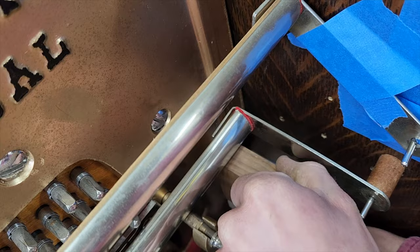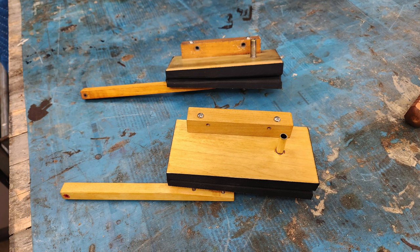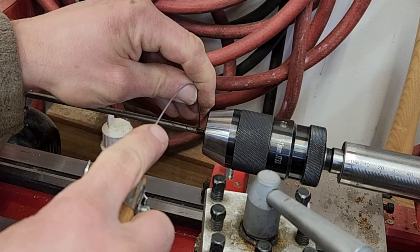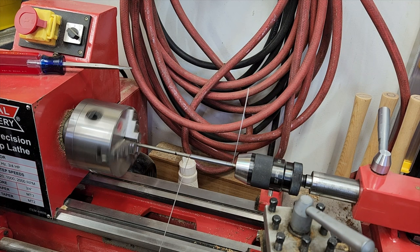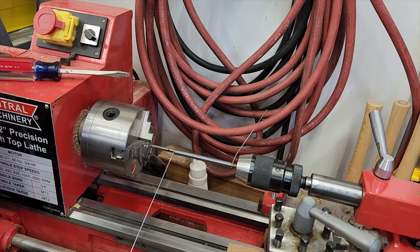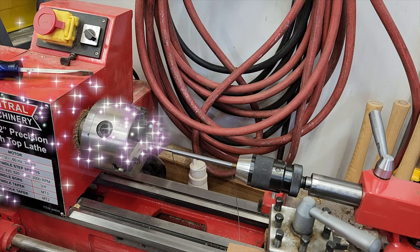I also had to copy the pneumatic that moves the rail. I used an original from the piano as a pattern. This setup requires a spring to lift the rail away from the hammers when not in use. I'd never made springs of this size before, so things were a little tense at times. Spring is in the air! Boing.